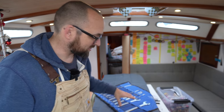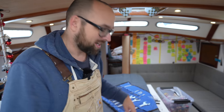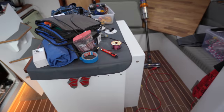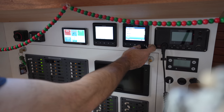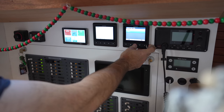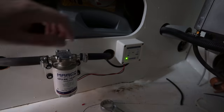Before I start transferring diesel into the kitchen island tank, it would be nice to get the tank sensor in that tank hooked up. Unfortunately I didn't run the NMEA 2000 cable I needed to that position last week before we installed the settee table, so I kind of have to take everything apart. Bear with me a second. It's about an hour later — the boat is a giant mess — but we should now have a second diesel tank we can add to our GMI 20 display. Tank level, fuel, tank ID number four. The tank inside the kitchen island is bone dry — let's see if we can change that. Fingers crossed.